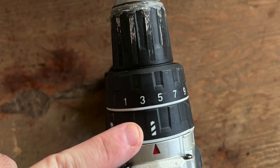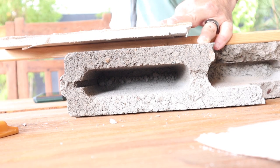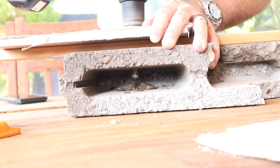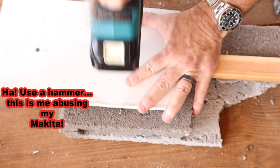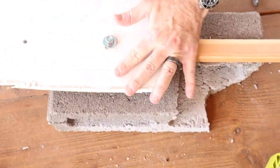I select drill on my Makita multifunction drill and drill through the drywall into the wood. Then I go to the hammer drill and add the concrete drill bit — you definitely need this thicker and heavier bit to get through that concrete. Here I am using that anchor sleeve, pounding it in with — not a hammer because I couldn't find one at the time. That thing takes a lot of abuse.